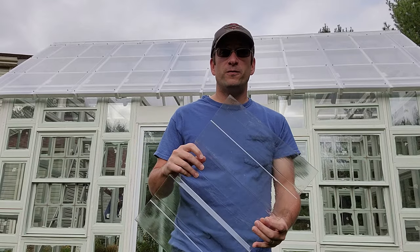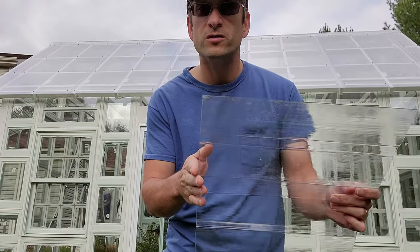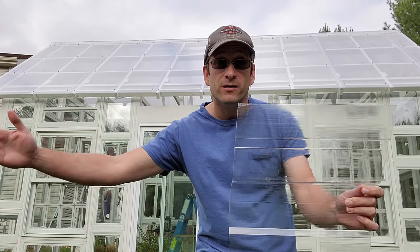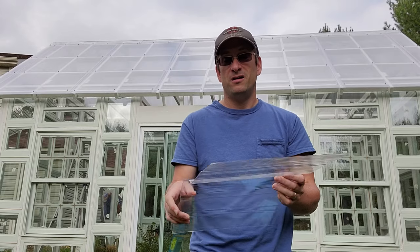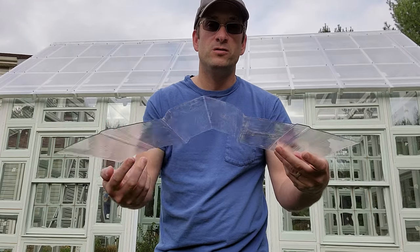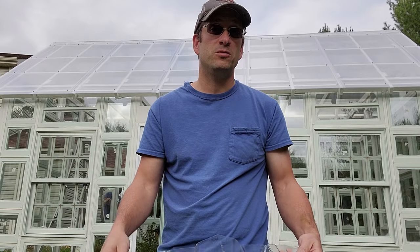This particular roof comes with a roof ridge. This piece was originally 4 feet long this way. I cut it off, as in this is one of my scraps left. So this would go on your roof ridge at the very peak of the roof, and you just slap this down. That's how you end up keeping your roof from getting water in it. So it's pretty simple. That piece in particular, you had to screw every 12 inches or 1 foot, just to make sure it was down and in place.